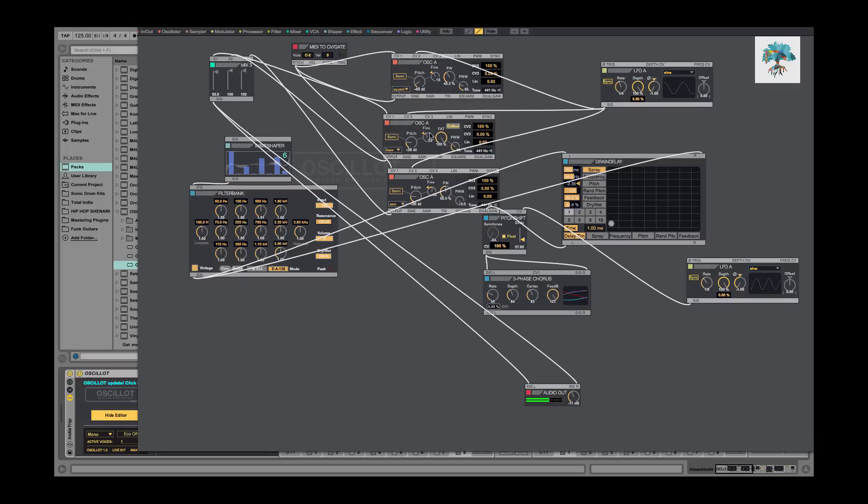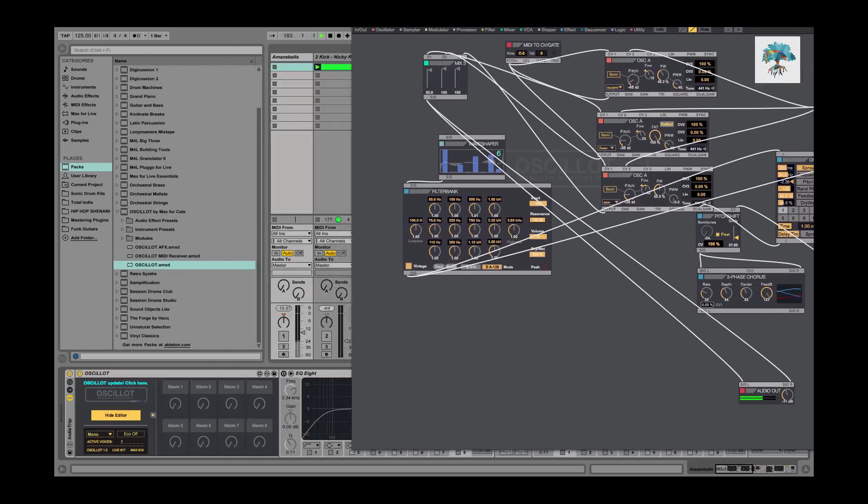What that's doing is modulating the pitch for each one of these oscillators. From there I'm taking the output of each oscillator — output, output, output. There's a way to hide the wires but I haven't looked it up. Then I have a mixer. There's a three-channel and an eight-channel option. I use the three-channel, so I can mix the three sounds together — these are basically just gain controls. First oscillator into channel one, second into channel two, third into channel three, and the audio comes out of the audio out.